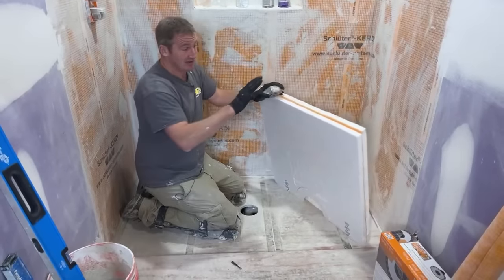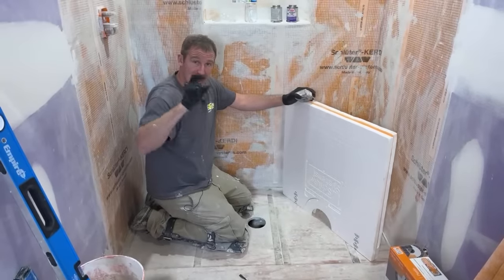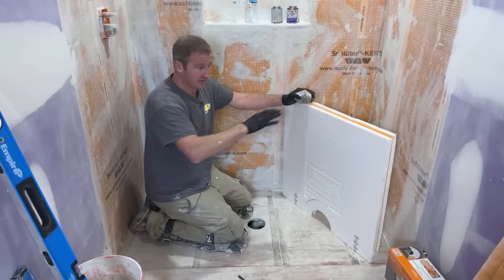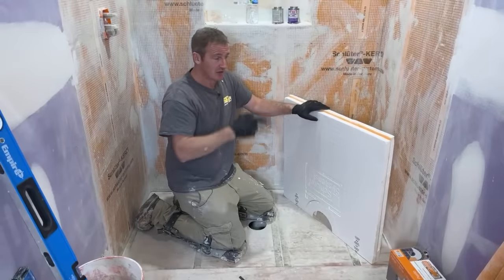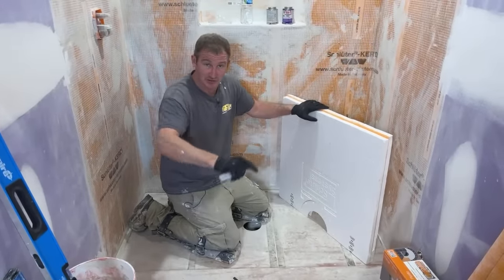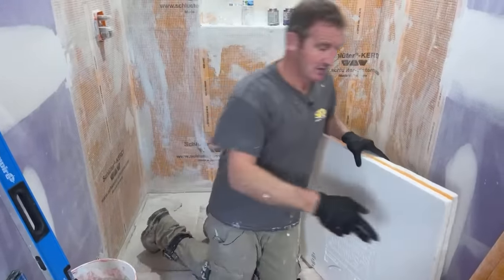But just know that in a shower, a 30 inch by 60 inch shower with the Schluter system, you're going to have to raise that floor 1/4 inch or more to meet up with this. So I'll get into more detail like that. I'll definitely be having some more videos on my channel addressing how to do this. I do have one already on there where I used floor leveler to match up with a curbless shower. So definitely check that out on my channel here.